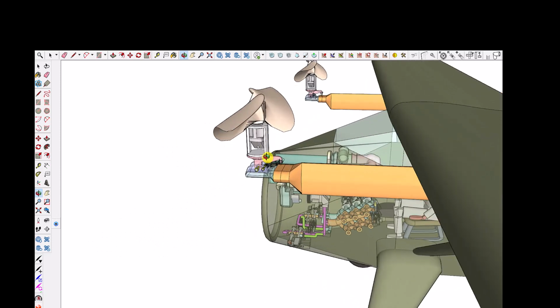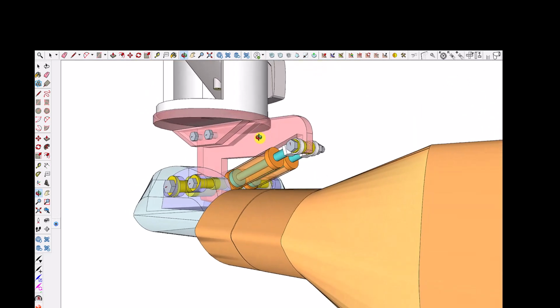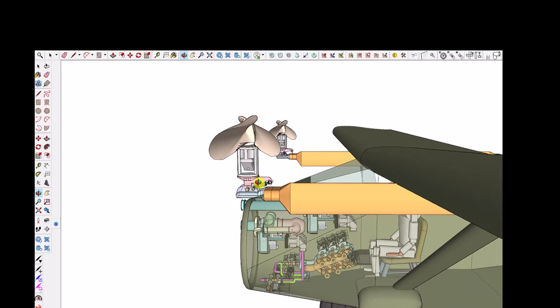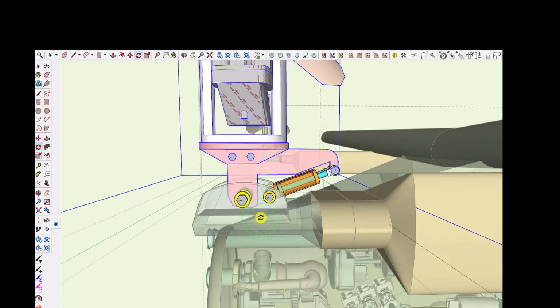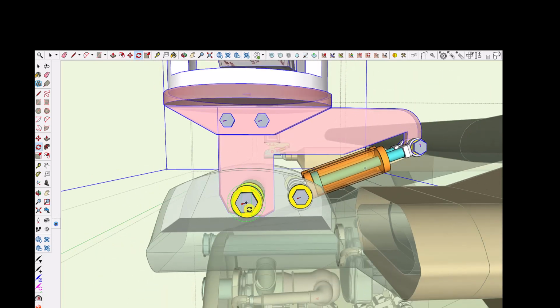tilt. And so I built this tilting structure, and it runs on two pistons. The reason I put two pistons in there is just for redundancy. And I can show you how this would tilt. So you can see that this support beam is holding up this holder, and this holder has a bearing. I don't think it needs to be a ball bearing. It could be an oil impregnated bronze bushing bearing, and you can put a turning controller inside SketchUp on the long axis of that bolt.